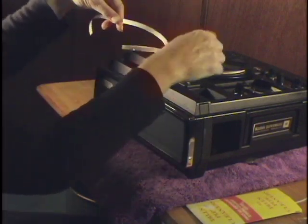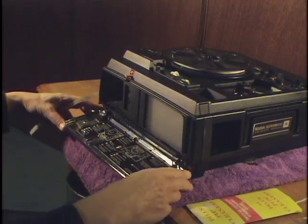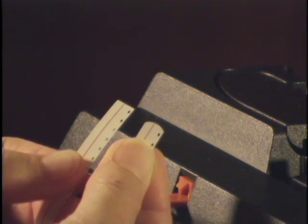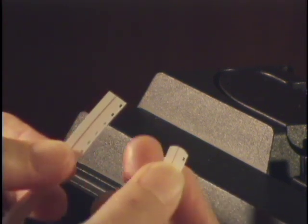Film has got the perforations up as directed. Before I start threading, I'm going to go to the side, which opens up, and there's a little clipper for the leader. You have to turn it up and seat it on one little sprocket guide and do a snip. The short of it is that a rounded edge works in some projectors, but this projector wants a completely straight cut.